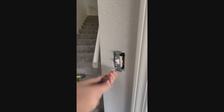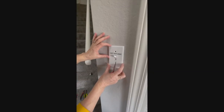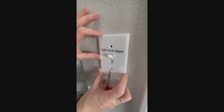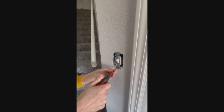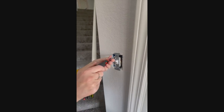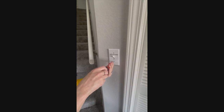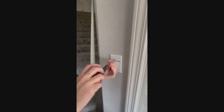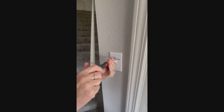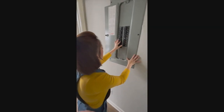As you can see here, our light switch is sitting a little bit too far back behind the faceplate, and that's okay — all we have to do is remove the faceplate and then loosen those screws a little bit. Now we can put the final screws into place. You'll want to make sure that these screws are snug, but don't tighten them way too tight, otherwise you could risk cracking your faceplate.